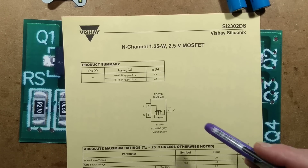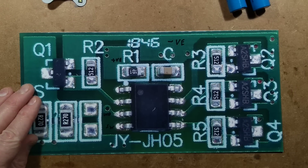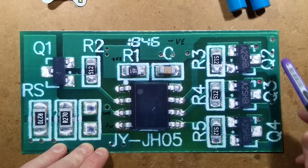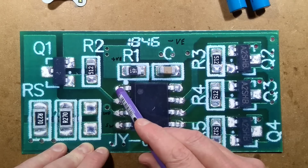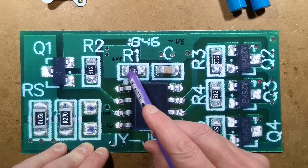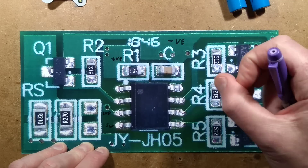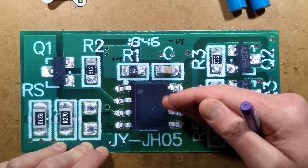It's quite good to note that these are rated so high. It's a very common MOSFET used as a generic transistor in many products simply because it's cheap — it's one of those standard transistors. Looking at the circuitry: the negative rail goes to all the transistors because they switch to the negative rail, has a capacitor, and also goes to pin 8 of the microcontroller. The positive of the microcontroller goes to pin 1, and it doesn't connect directly to the positive rail — there's a 100-ohm resistor (marked 101: 1, 0, 1, and 0 as a multiplier = 100 ohms) which feeds down to that coupling capacitor and then to pin 1. That means even when there are switching spikes — like when the LEDs turn on or especially when pulsing — that provides a bit of filtering and avoids the processor getting upset by the pulsating voltage.